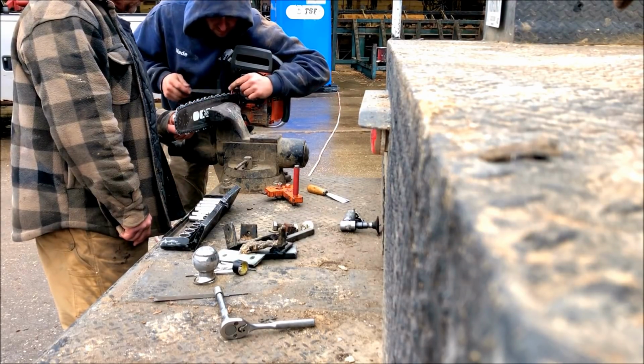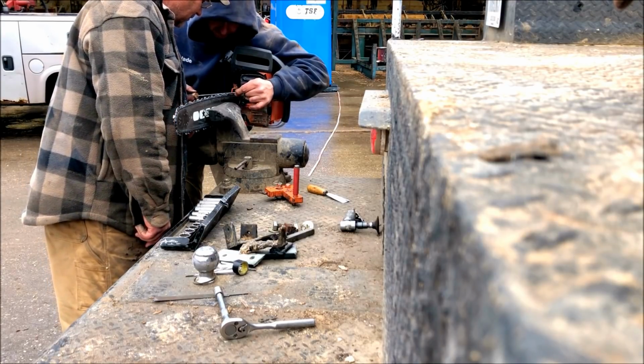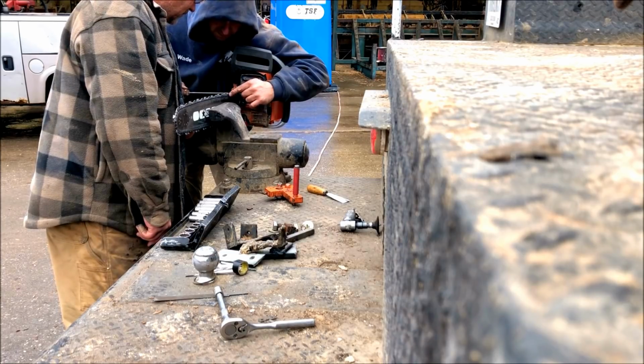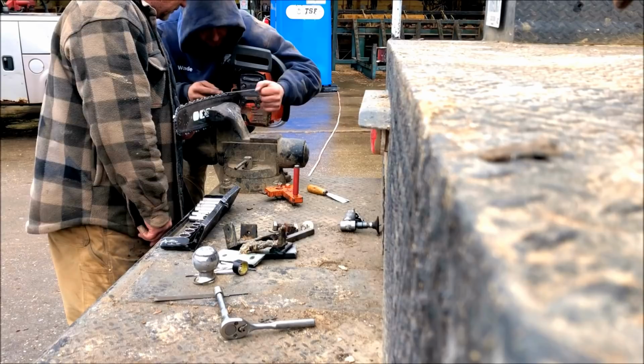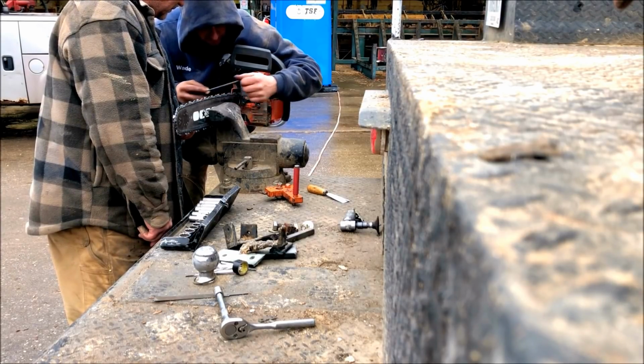I'm focusing mainly back here. I'm getting my angle right where it's uphill about 5 to 10 degrees. And I'm making sure I'm deep enough in the gullet. But my focus is right there. If you push too hard, you get to where you screw up right at the tip. And I'm just watching that tip till it finally makes me happy.